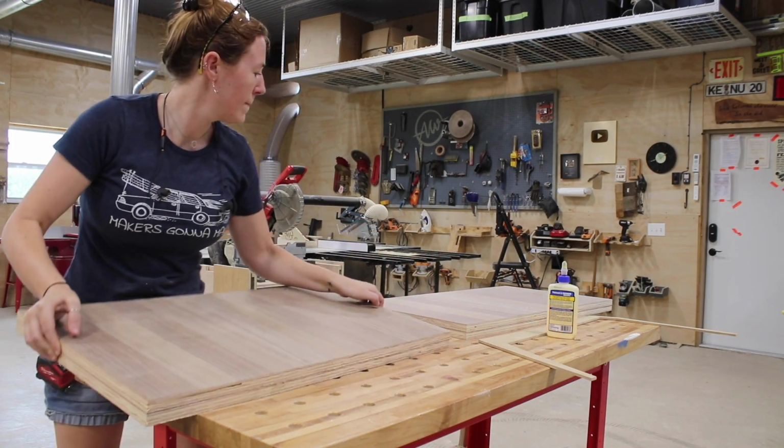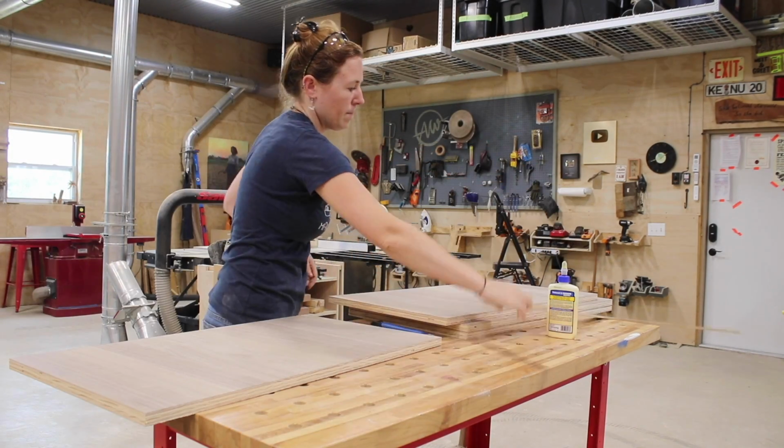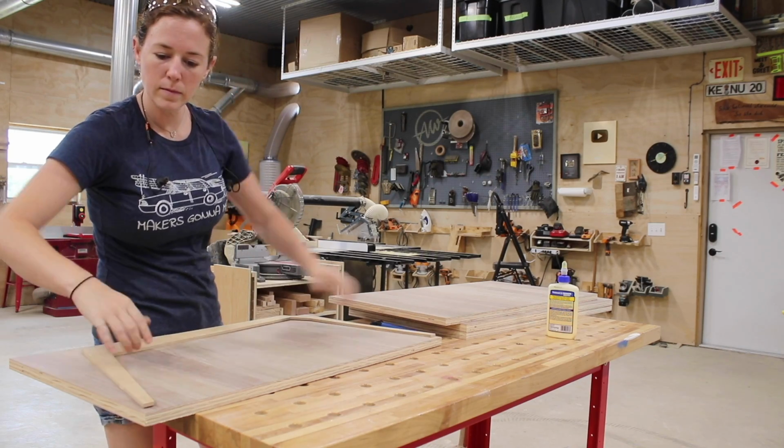With the direction figured out and a few modifications I made from looking at the prototype, I started building it from walnut plywood. Actually getting both chairs from just a single sheet of 3/4 inch ply. To make it more stocky and sturdy, a lot of the parts are 2 sheets laminated together.